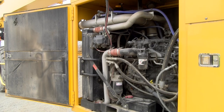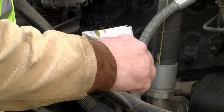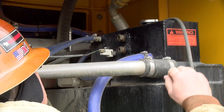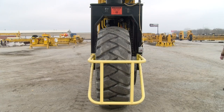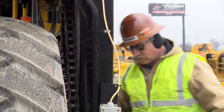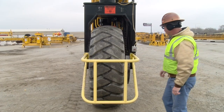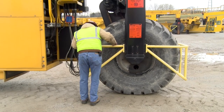When it comes to pre-operational inspection of your equipment, checking and knowing that your equipment is ready before you operate it goes hand-in-hand with safe and proper use. You cannot assume that equipment is ready to go simply because you are the last person to operate it. It's up to you to be sure that the crane is ready for operation. For example, certain checks must be made, such as the coolant level, the engine crankcase oil level, as well as the hydraulic oil level. If you are personally trained and assigned the responsibility for all pre-operational checks, refer to your operator's manual for detailed information and the necessary precautions and procedures. Like an airplane pilot, make it a habit to do a walk-around inspection of your equipment to be sure everything is normal before putting it to work.